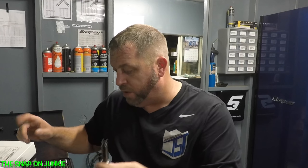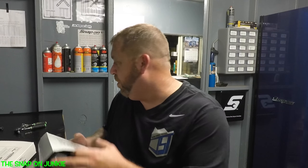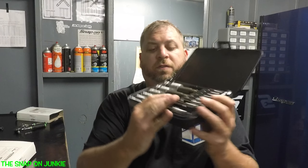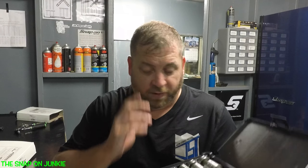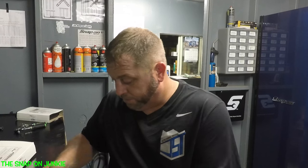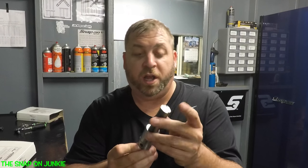Don't make that mistake - most taps are four-fluted, so get four-fluted. Let's look at what you get. This is the complete set and I got this from McMaster Carr for $311. I figured this is a great thing if we do not have to go to a machine shop. Kind of how these work is I have them all the way up to one inch. If we broke a one inch tap, these are designed to go in, grab the stuff, and pull it out. These will work in a cylinder head anywhere.